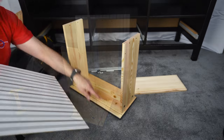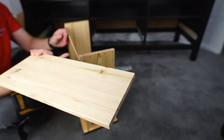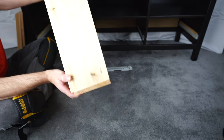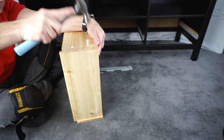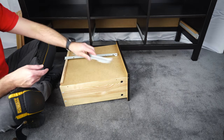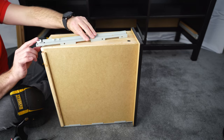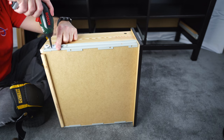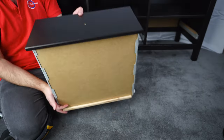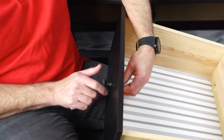Slide the back panel into the gap — the colored side is the inner side and the plain side goes at the back. There's a gap at the bottom of the back panel; slide it in and then slide it into the side panel. Put the drawer on its side and secure with two plastic plugs on each side at the back. For the rails, the wheel is always at the back of the drawer. Secure each rail with two screws — one at front, one at back — making sure screw heads are completely flush. Attach the door handle with one screw coming from the inner side.